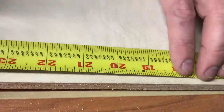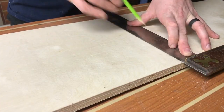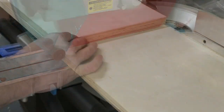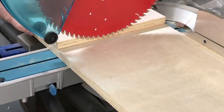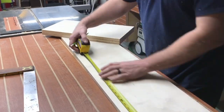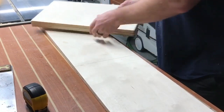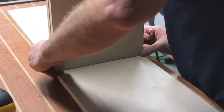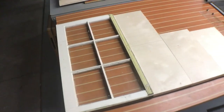We made a couple measurements here — my measurements came from the window. I'm making the tops and bottoms of the cases and cutting them at the chop saw. Woodworking is sometimes about making mistakes and then fixing them. I realized my index mark was shy of two pieces of plywood. If I had cut where I originally intended, the case would have been too big and the window would not have fit. Luckily, I caught it.